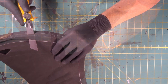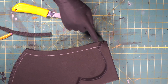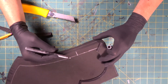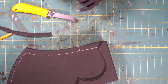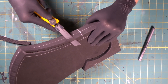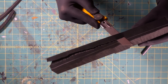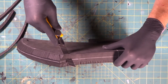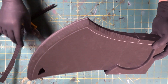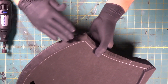Go slow because you're going towards your hand. Now we're just going to continue down here, but we're going to stop before we reach the back end because the back end needs to stay square — so we're probably going to go to right about here. Let's draw our line around there, so now we know that's where we want to stop with our bevel. We're going to come right out where our line is, and we'll take our time on this saw right there at our mark. Now with our dust mask on we're going to start smoothing this out to be a nice peak.